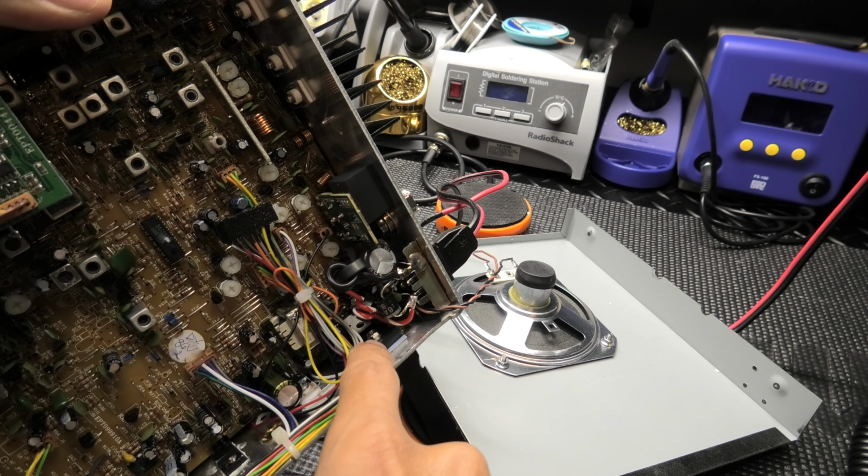Okay, nothing there. These are really nice and clean radios. Take it to 30. Okay, take it to 60. Show the second harmonic. Hardly any second and really clean. Nothing in between. So, really nice and clean radios.